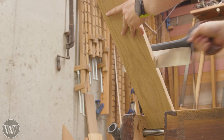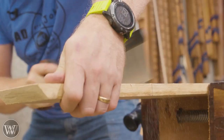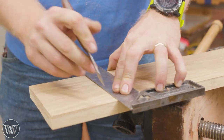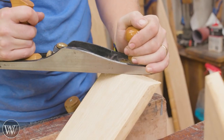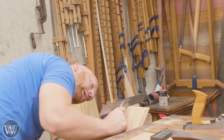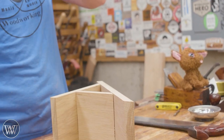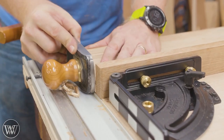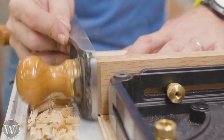Now we're going to move on to the donkey ears. For the donkey ears we need to cut three boards with a 45-degree angle running all the way along one end. We're going to cut these boards longer than we need them to be — it's easier to cut the 45 and then trim off the other end. We're going to lay out the line all the way around with a square and a miter square. Then we're going to make one cut that will give us two boards, then lay out one more cut that will give us our third board. Once we get it cut close to shape, we'll come in and plane it back to the line — just go to the line, plane it until it's square and true. Then you can plane up the other end and trim those to precisely the length they need to be.